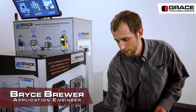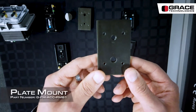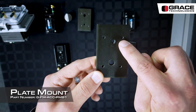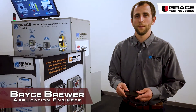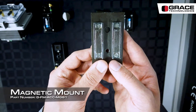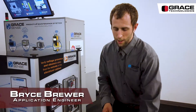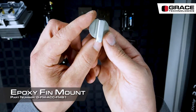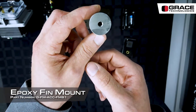If you didn't want to tap a hole into your motor or other piece of equipment, we have our plate mount base, which would be epoxied onto the motor and then you just stud mount directly to it using the threaded hole. Next is our magnetic base, which is the same as the plate mount base except it has two magnetic strips that allow it to attach to a motor bearing or any other rotating piece of equipment. Last is our epoxy fin mount base, which goes into the fin with epoxy and then you stud mount just like the others.